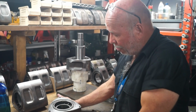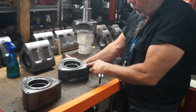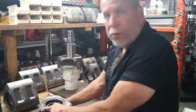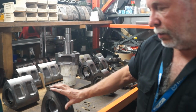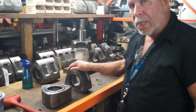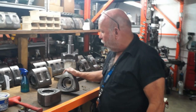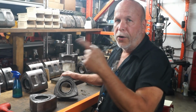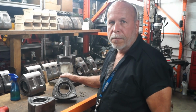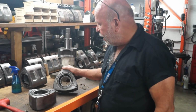Once that was done, I actually went slightly too much. Then across from it, I removed with a die grinder this little bit here, this little bit here. And that brought it into perfect balance. This was just absolutely crazy. Because how much would you say that was luck versus skill to do that? No, I actually had this part on and off at least 4 or 5 times. So it was just total laborious work to get it there. It wasn't like you didn't get lucky at all with.